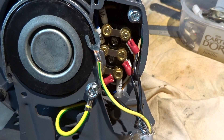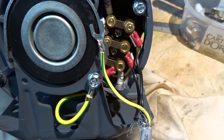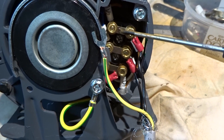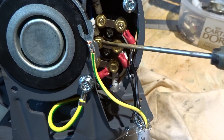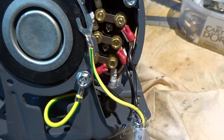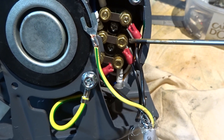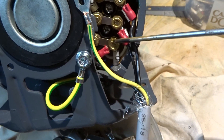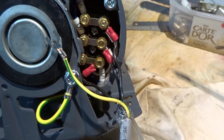I've altered the connections on the motor to facilitate delta running, which has involved moving these tabs — they were along here — and just running them across terminals: V2 W1 which is this one, U2 V1 which I think is that one, and W2 U1 which is this one. At the moment I haven't connected to this which is there.